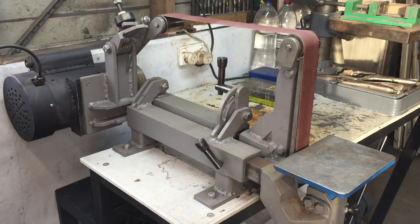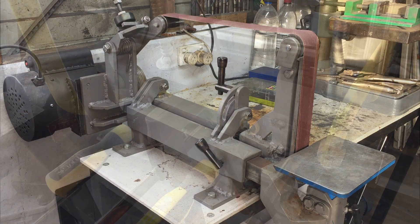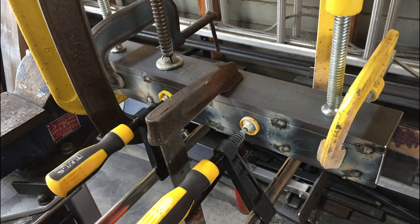I'll put up the build photos and talk through them for more insight on how this machine was built. The first parts to make are the main tubes — where the platen and table attachments go. I used flat bar 10mm thick by 60mm wide for top and bottom, and 10mm by 40mm wide for the sides. There's a square bar down the center. I clamped it together using shims cut from a soda can for aluminium shimming, and tacked it before fully welding.